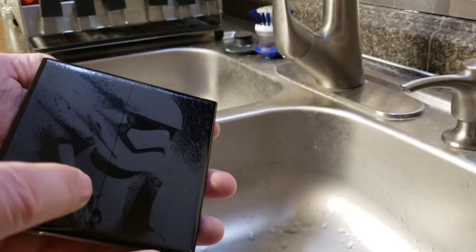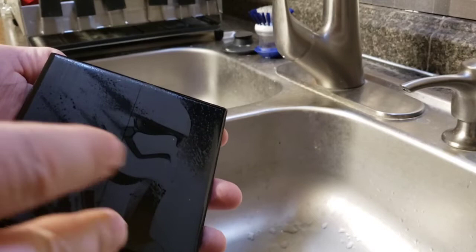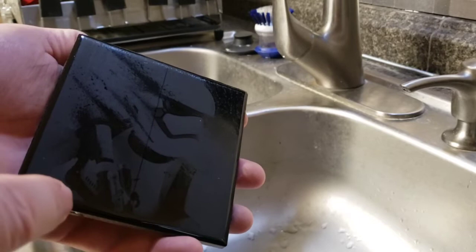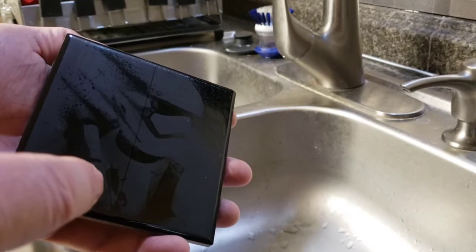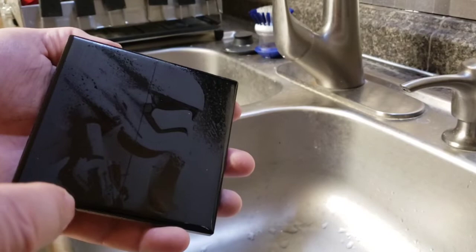That's another reason I don't like plugins — I've already had to make some gamma adjustments. On the right side I upped the gamma and upped the speed from 4300 to 4600. On the left side I decreased the contrast from negative 15 to negative 25 to make it even darker — I just want to see how that comes out. So we'll clean it off and see how both sides look.